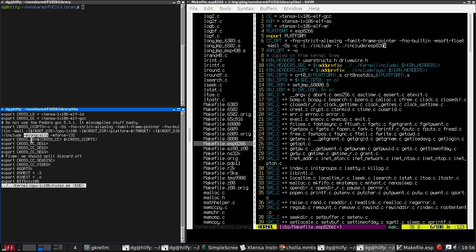and to other stuff like the code we put into the instruction RAM and so on. However, we don't need that. And force L32, which causes the code to always generate 32-bit accesses. This is necessary to allow us to put data in the flash and the instruction RAM. Now, we are not going to be using either of those.